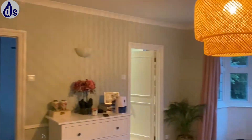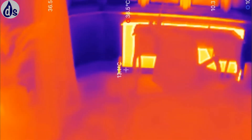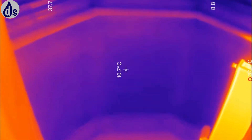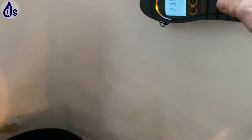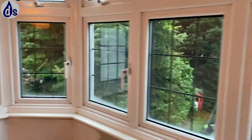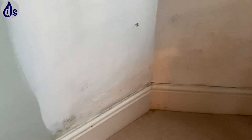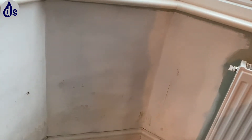In the main bedroom, this is where you're getting the most mold. Mold grows where relative humidity goes above 85%, as do allergic dust mites, dampness and mold. This is a damp meter, and you can see the condensation — it's dribbling off the window, and we're only midway through what's not even a particularly cold day. I understand you've had attempted damp proofing and anti-mold paint applied.